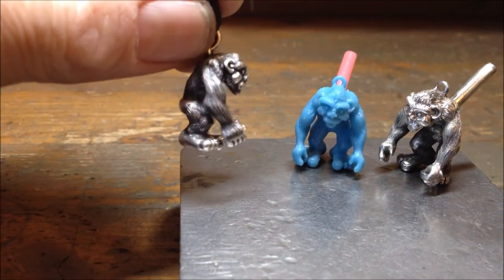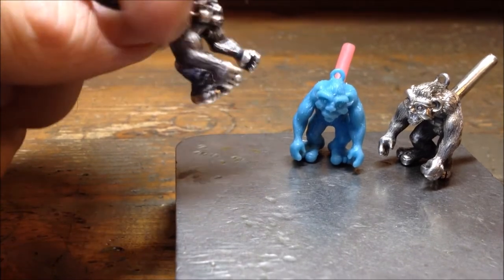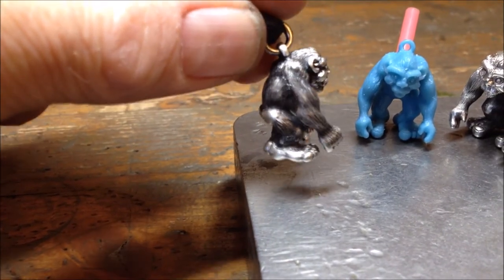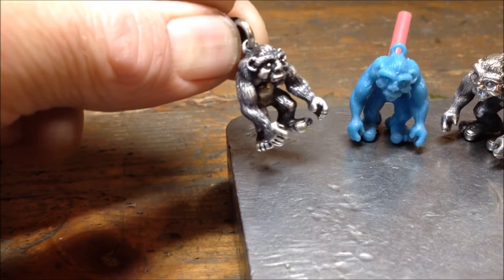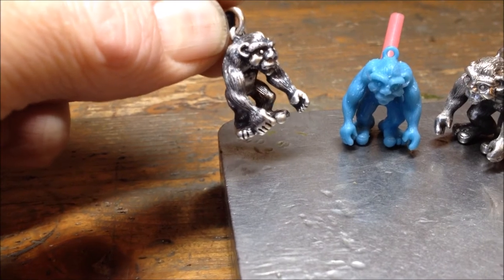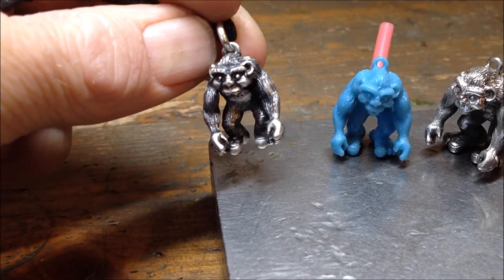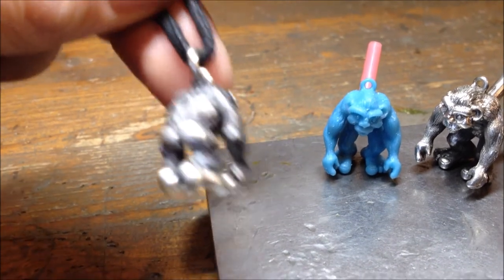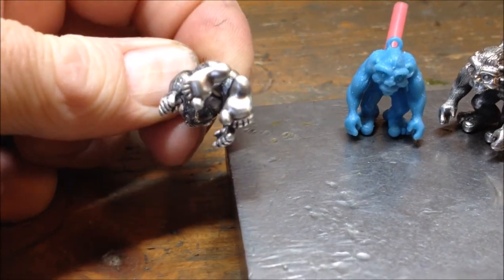This is where you end up with a silver casting. Again, I've gone over it with my gravers and various other tools to make it look as good as the original. The black fur on it is where I've antiqued it — you use an oxidizer to basically age the silver, then you polish it again, or in this case put a satin finish on it to make the highlights stand out. I supply this one on a waxed cotton cord, but if you want it on a chain, just ask.